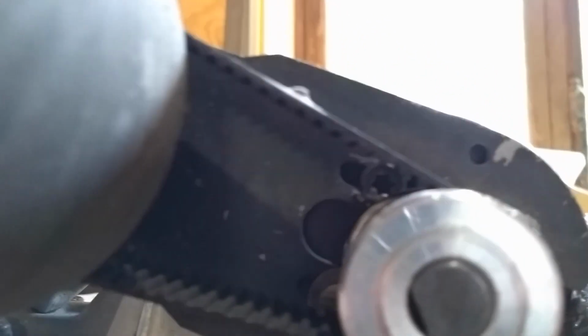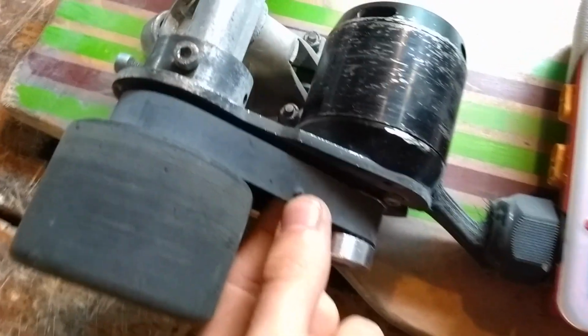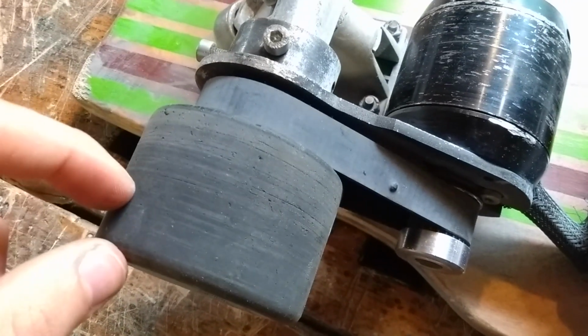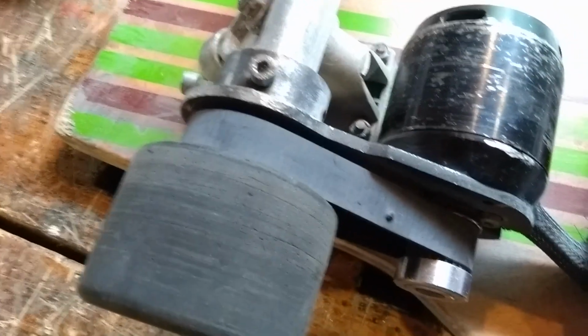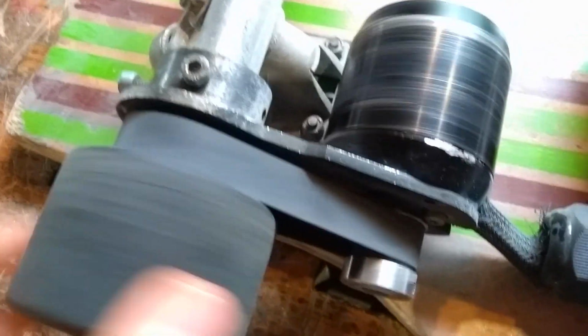It means the belt's teeth, you can see here. The teeth are very thin, and it's almost the bare minimum you need for electric skateboards. And oh, I see here something has penetrated the belt. But I recommend 5M for the belts because then you have bigger teeth and can handle more power. But 3M can handle me, and I can pull away very fast.